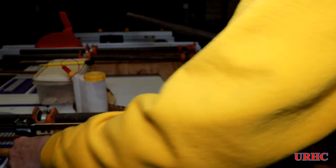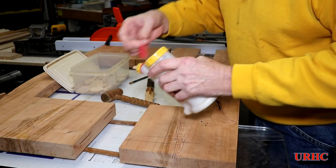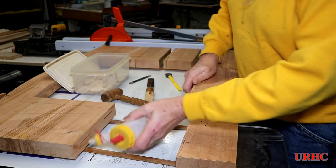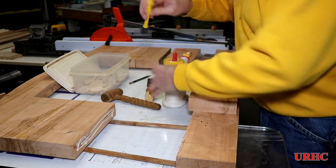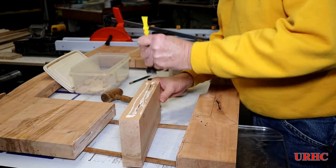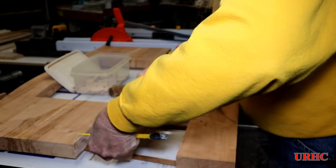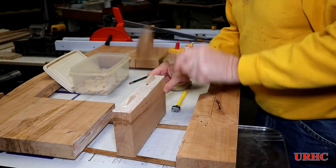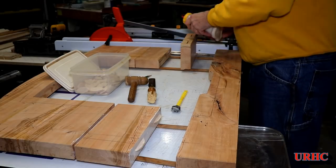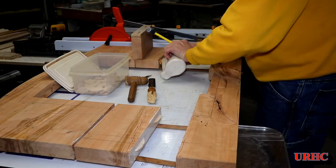I took a two-hour nap, came back down, took the clamps off, and now gluing up the other half — pretty much a mirror image of the other side. You can see how that little glue bot makes it easy to get glue on any surface no matter which way it's aimed, without having to squeeze from the bottom of a bottle. You can see the first piece — all edges came out perfectly flush with the biscuits.